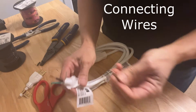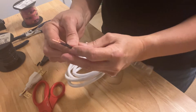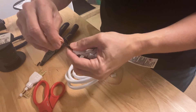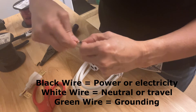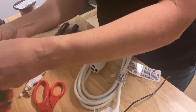Let's practice connecting two wires. Since this is just for practice, we're going to connect an extra wire to the black wire coming out of the extension cord. You're going to twist the wires together — it may be easiest if you use pliers to twist the wires together. This is the same process that you're going to be using if you're installing a new ceiling light.